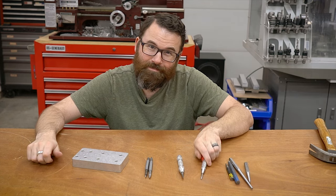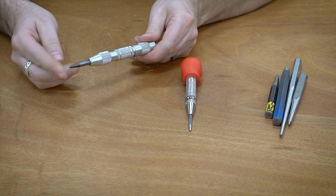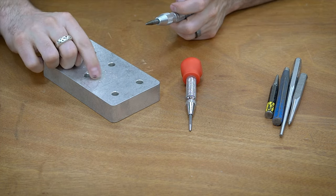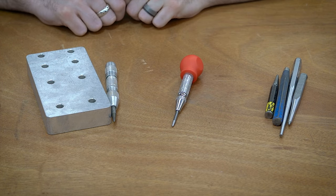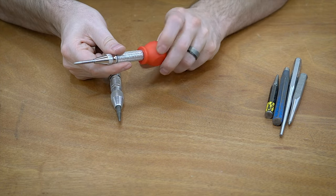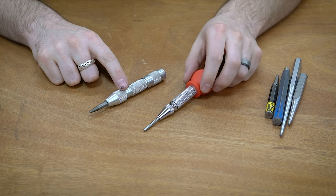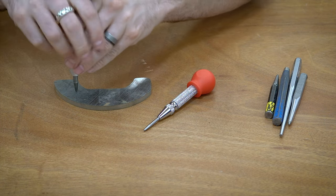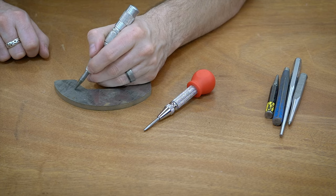That's where these spring-loaded guys come in. I'm sure all of you have seen a spring-loaded center punch like this. You just press down, and when it hits a certain point it just punches. You press and it'll just create a little dimple. These are nice and handy because it's just one hand and you can very easily punch. The downside is they just don't have that much force. You can adjust them — on both of these you kind of unscrew the back. But the thing is that at the maximum setting, they really don't produce that large of a divot. On S7 tool steel, I can barely feel that with my finger.